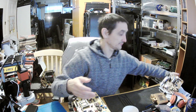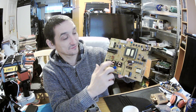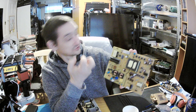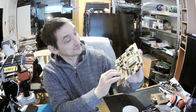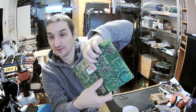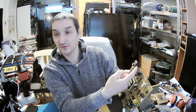Look — here you've got as well an input, double fuse for phase and neutral, the same principles. You've got a bridge rectifier, yes, a capacitor to charge. Then the main transformer, there's an opto-isolator somewhere — there are circuits without opto-isolator as well — but we've got opto-isolators here as well. And then you've got 12 volts here and backlight here, yes.